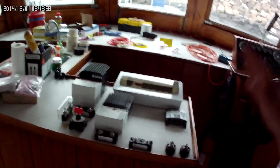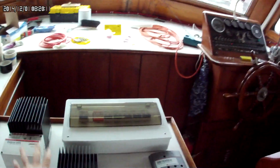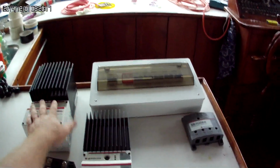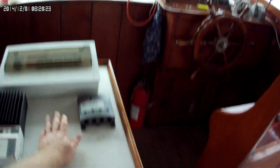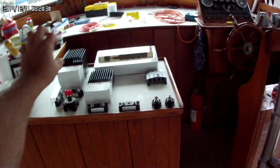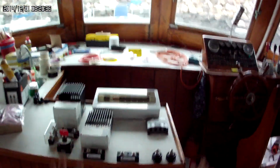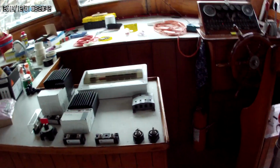But now, once the batteries get full, this is going to handle 1,800 watts, even though I've got 1,200 watts right now. If I were to put in another 300 watt panel, that's 1,500. So I'm protected. If my batteries are full, this can handle what's coming in. So I need a second one for the input on my wind turbines. So again, I have the second 1,800 watt water heating element, and so my batteries are happy, safe, and protected. Inductive motors, I've got the blocking diodes up to 200 amps.